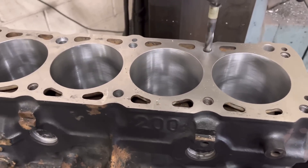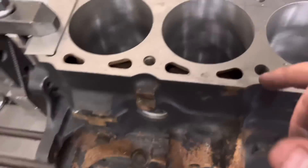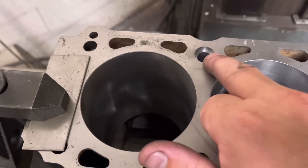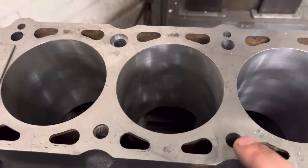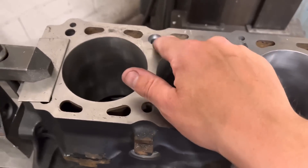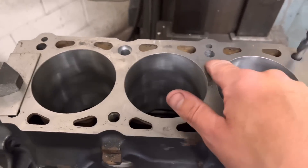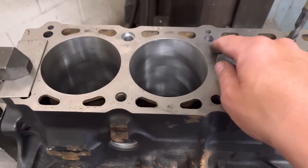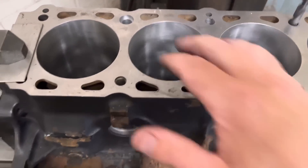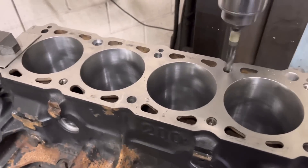So that's my mission for today. As you can see, this is the first block - we've done one of the outer six and the two inner six. Now, the two inner six: I said you don't have to put the 17mm O-ring groove in the top because it's not a through hole - this is all separate to the water jacket, as opposed to these four which are not. So yeah, just going to crack on with this.